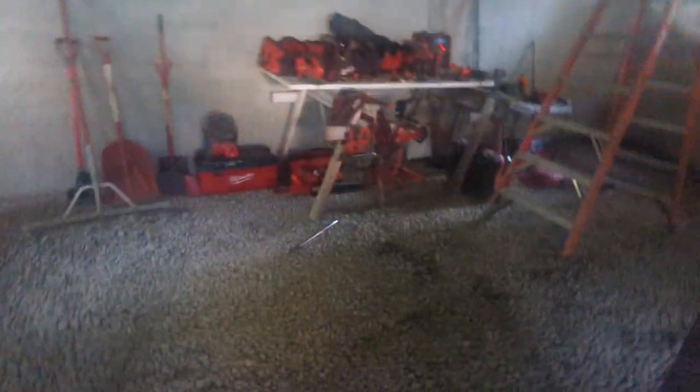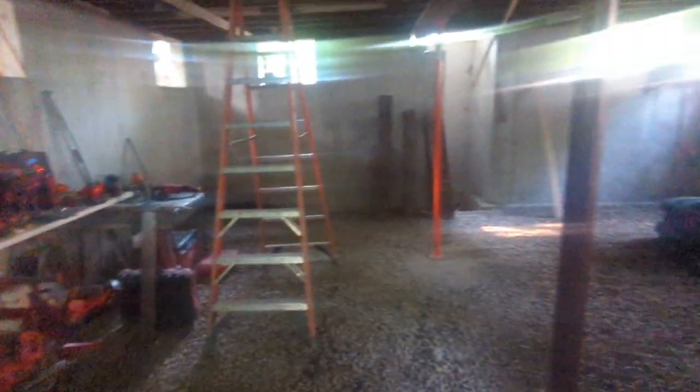And I'll take some weight off of this post and go up and uncover that, which I assume is just, well, no. See, that plate over there is flush. No. He's additional to the joist height. So anyway, I'm sure that's just more plate. I'll pull that fascia thing off there, get the cable out of there, get all this crap pulled back and out. And we could start with, you know, we got to get our LVL and sister those joists that I said didn't make it to the beam and stuff. So that's all stuff we can do tomorrow. And so for now, we're going to call it a day, take some batteries and get them charged up for us. Hit this thing again in the morning.